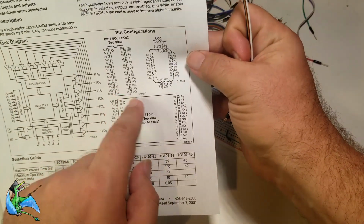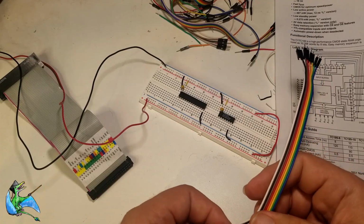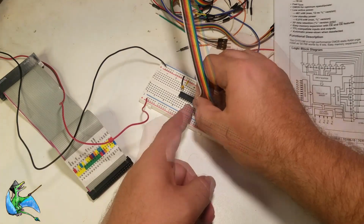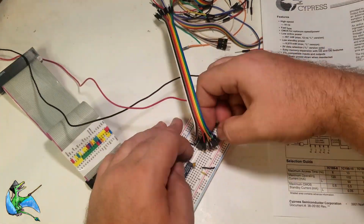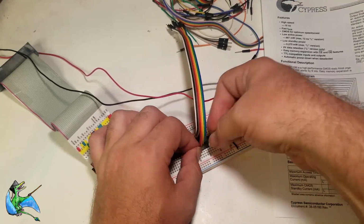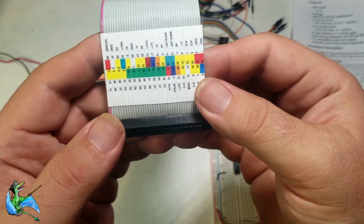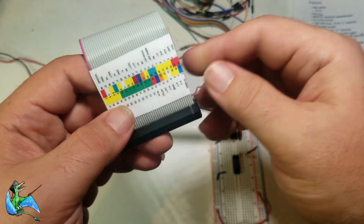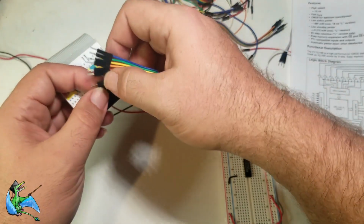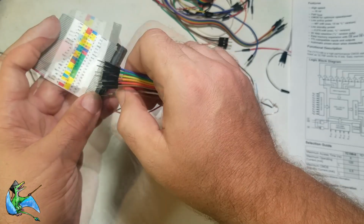The first group of signals we're going to wire to the TRS-80 is the data lines. These connect to pins 11 through 13 and 15 through 19 on the memory chip. Technically, since this is a RAM that's only going to be read and written by the CPU, it wouldn't matter if we just randomly connected those pins to the 8 data lines broken out on our bus cable. But since I have bigger plans in mind for this setup, I'm going to take the time to reshuffle the pins at the breakout so the lines are all connected to the matching designation.